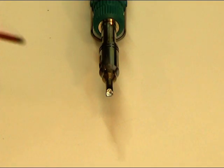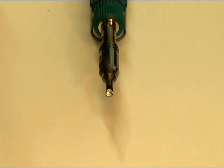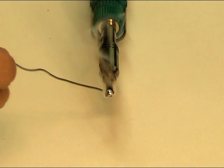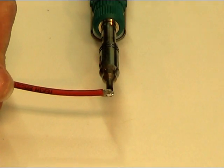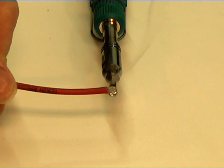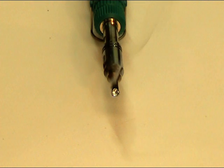To tin our wires, just cover the end of the wire with a bit of flux, then add a ball of solder to the end of the soldering iron, and then just touch the cable on — it'll then take up the solder.